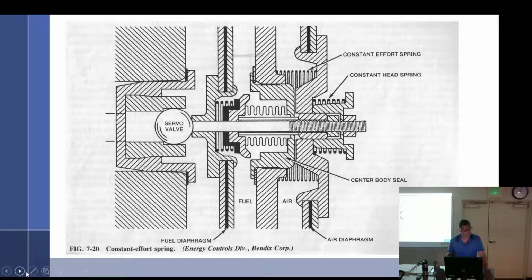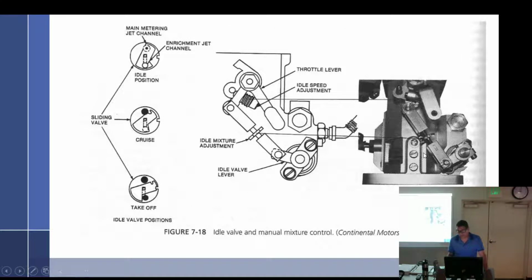How's the safety? There's a spring. There's a spring behind it, and the wheel is cut out. So if you look at it on the side, it looks like this as it goes around. And there's a spring on the back side, and the spring just kind of sits in this. And it's not even a tight spring. So you just pull the spring down a little bit and move it and let the spring go, and it gets in the groove, and it works.